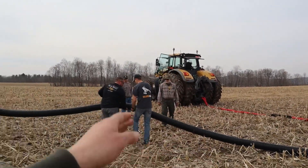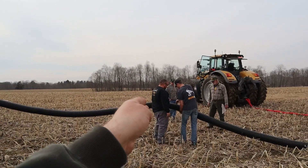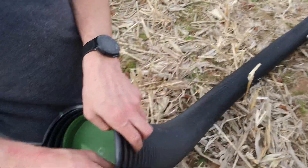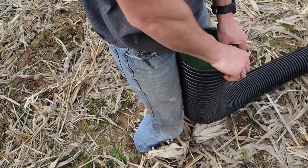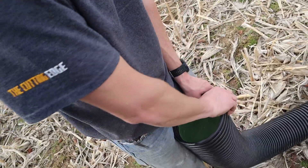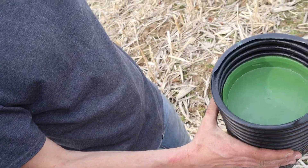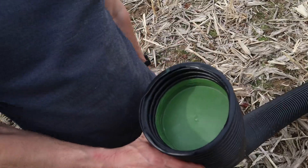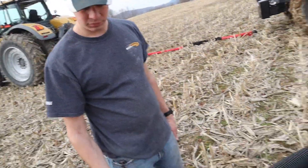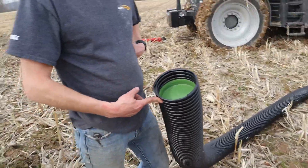There's our property line — we have to come out here. We're cutting the line, they're going to cap it, and then I'll pull this line on through. Four ribs deep. Here's our cap to keep critters out — just keep it full of dirt. Make sure you're a couple of ribs down so it doesn't crush. Now we just run it into the ground; bigger they are the harder to put in.